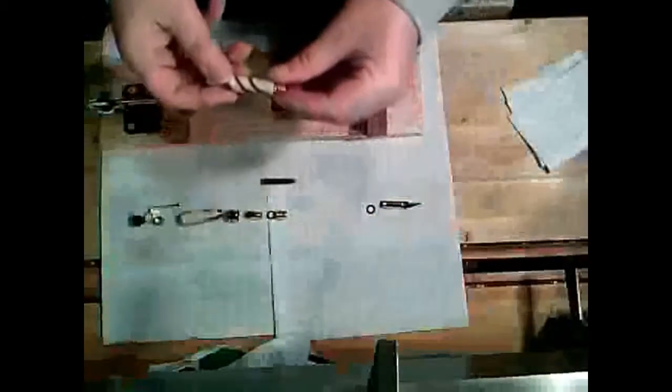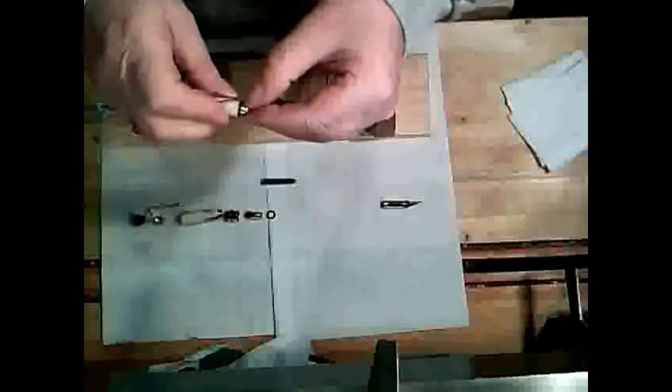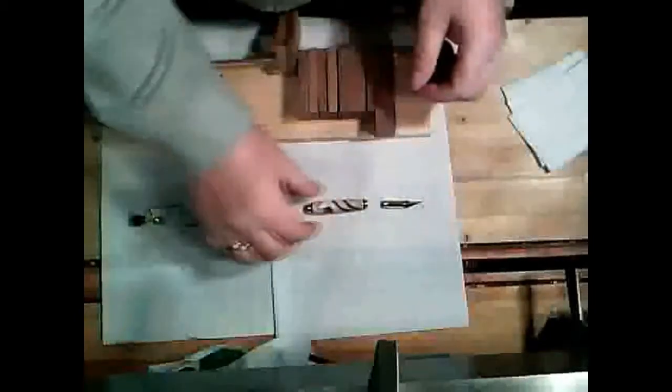Pick up the lower blank, pick up the lower assembly, and we get those two pressed together. Top assembly. Good. O-rings go on these. And there's a little groove below the teeth. And I normally just put my thumb on the top and just turn it around until it seats. Other side. When you've got big thumbs like me, this is really fiddly sometimes. But we get it on in the end. And again, I just run my thumbnail around to seat it. So that is the lower assembly.